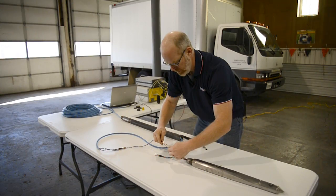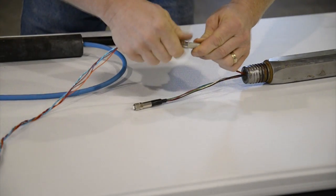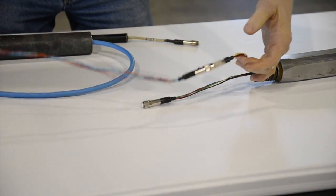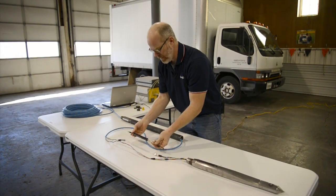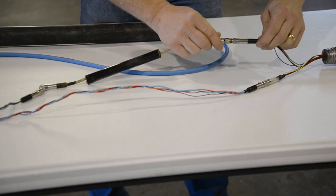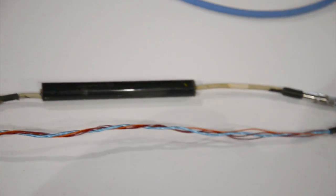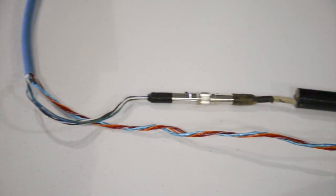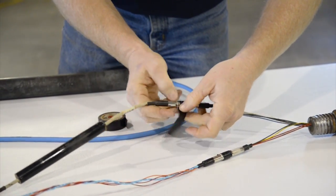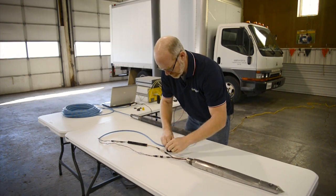When you connect the trunk line to the probe, the longer line with red and orange wires pairs with the shorter line on the probe, which has two red wires. That connection creates room to fit the OIP power module in between the other wires stemming from the trunk line and the probe. Once you make all of the wire connections, it is important to secure them with electrical tape. Without this step, the connections could come loose during operation, and you'll have to retract the probe.